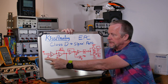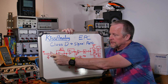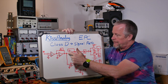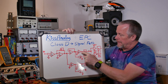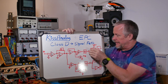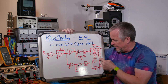As the signal comes in, you go through the capacitor — basically a buffer — to drive it into this gain stage where this is the volume control. You've got a minus and a minus: two minuses make a positive, you're back to positive. Then you go through a plus, so you're still plus. Then you go through a minus, and this block right here is what I call the zero detect, which creates a square wave that modulates the audio signal. Then we have a feedback stage — a feedback from this stage comes here and this feedback comes here.